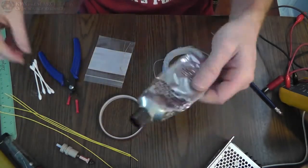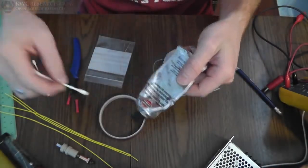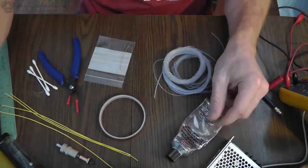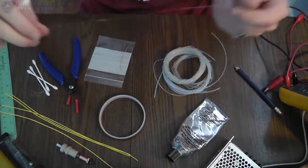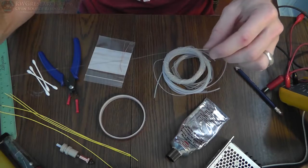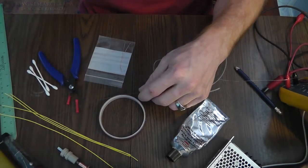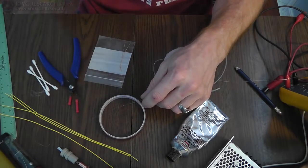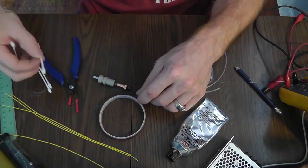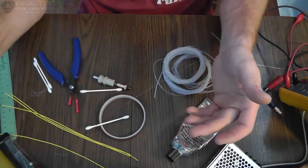And then I'm going to basically take this stuff in cotton swabs, and put this on top of the tape and mix it all together and just go through the whole thing and sort of layer this wire. I think I'm going to go with 2.25 amps, which gives me somewhere around 28.5 watts of power, and it's going to be directly over the center of this guy, so I think that'll be plenty of temperature here. The thermistors I'll add later, but I had them out. I have no idea how well this is going to go. This is a trial and error experiment.